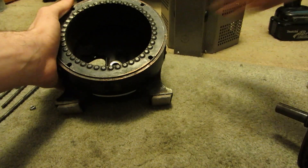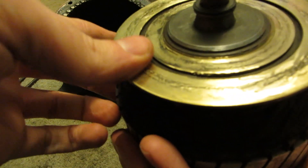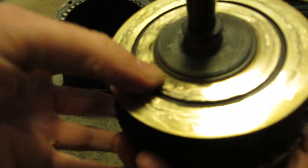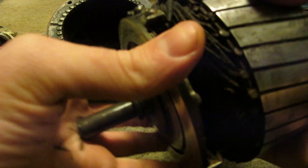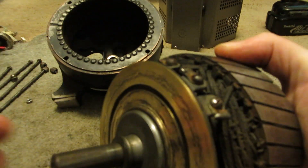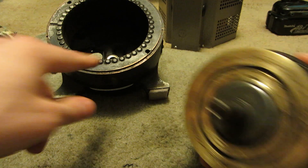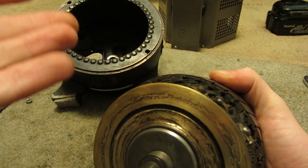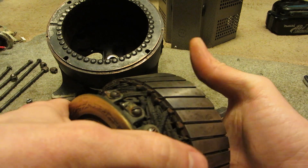This is the interesting part — your rotor. You've got your contacts there; they look like brass contacts. This had quite some divoting on this side, which I've polished out as best as I can — that's why it's kind of loud. What gets me is: with this motor, why would they have the only set of windings on the rotor? Why not have the windings on the stator? Why go through the trouble of having a wear point here and brushes? Why not just have a solid core without windings on the rotor part? That's what gets me.